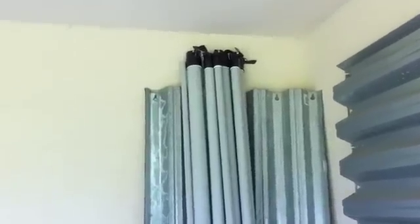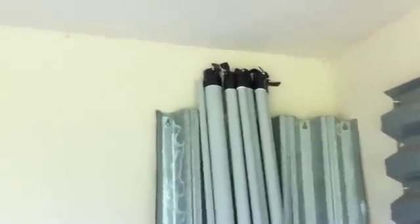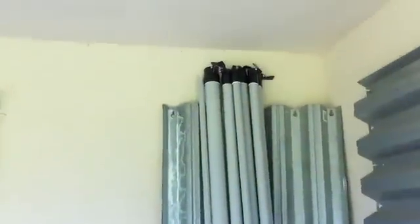I've got all the tubing done and I'm going to let it cure. It's a little hard to see against that hurricane shutter, but all the ends are marked. They say 48 hours for tack and 7 days for full cure, but through experience down here in a warmer climate it's much shorter. I won't be putting it up for a few days so it'll sit out here and cook — it's about 90 degrees out on this porch. Just make sure you let those cure up real good.